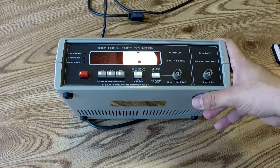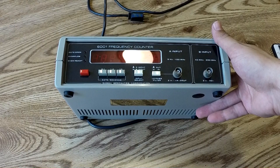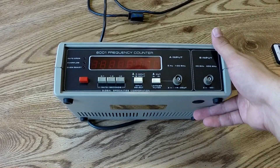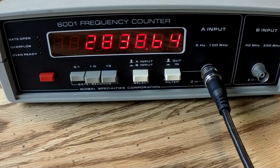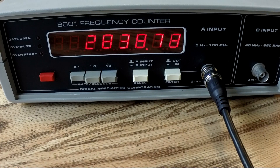We'll go ahead and plug it in and get it started. Maybe I'll pull over my signal generator and see what we get. Okay, so here we have it — turned it on. Got it figured out, I think. At first, the top digits on the seven-segment display weren't lighting up, so I think something's loose in there. I picked the unit up and set it back down and it worked, so there's a loose connection I'll investigate later. I'm using an old function generator — actually it does square and triangle waves and goes up to three megahertz. It's old dial-based with no display.